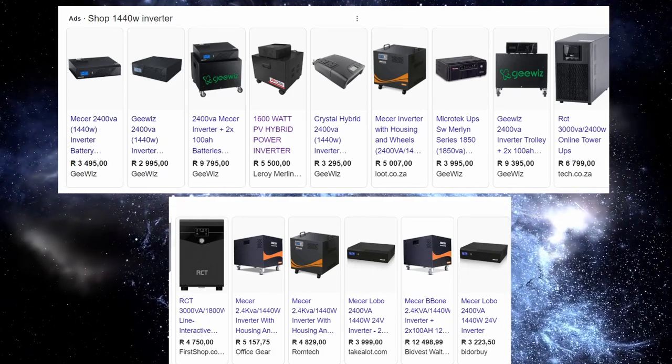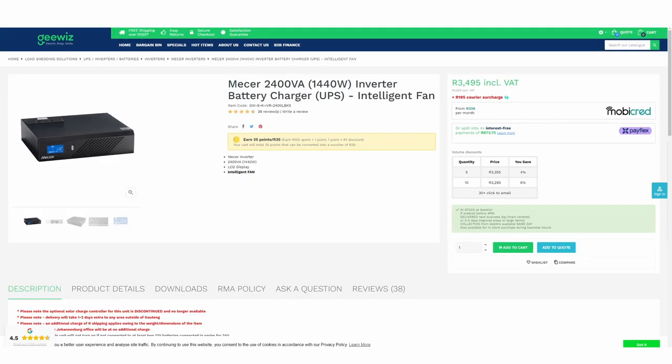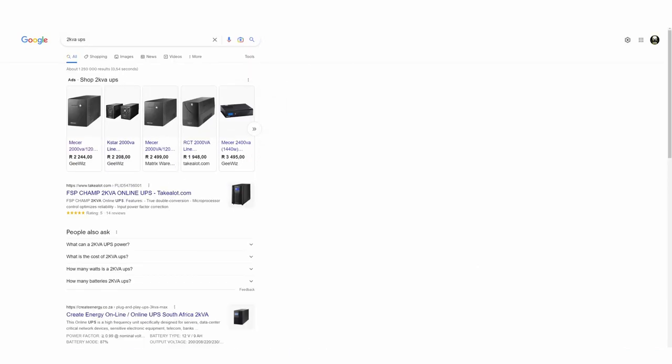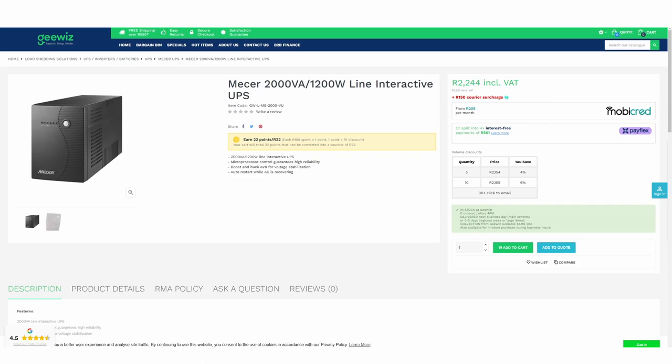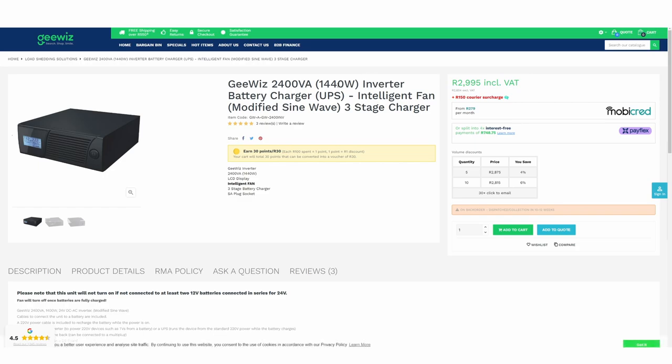In terms of calculating what your usage is and what you actually need, they recommend an 80%. So for interest's sake, if your PC is running a 650 watt power supply, it's not entirely 650 watts. You can work it out differently, because your PC will actually pull less power than that in most cases. Some cases it'll pull 600 watts, but even that, it won't pull 600 watts. Your PC will generally pull lower than that. So when you're speccing out a power supply for your PC, if your PC pulls 500 watts, you should allow 650 watts for the power supply.